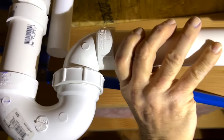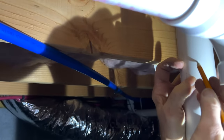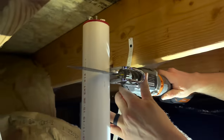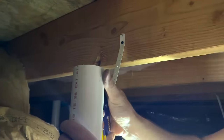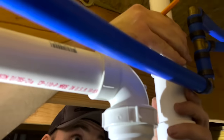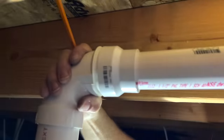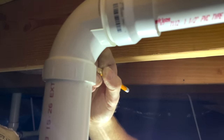I'm now going to take a 1-1/2 inch trap hooked to a 1-1/2 inch pipe that goes over to a 2-inch pipe and elbow down to it — I did need a reducer for this. I'm measuring exactly where I need to cut the pipe, then using a Sawzall to cut it off. After cutting, I deburr the pipe with a utility knife. After dry fitting everything, I take a pencil and mark both the 2-inch pipe and the fitting so I know exactly how to line up that elbow when I reinstall it — very important to do this step.